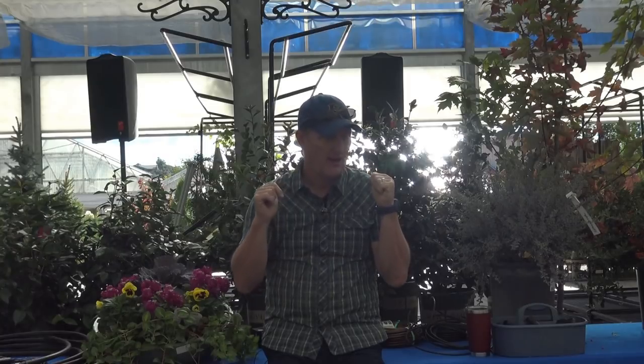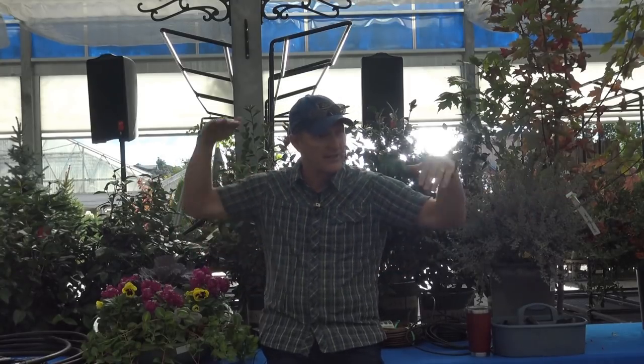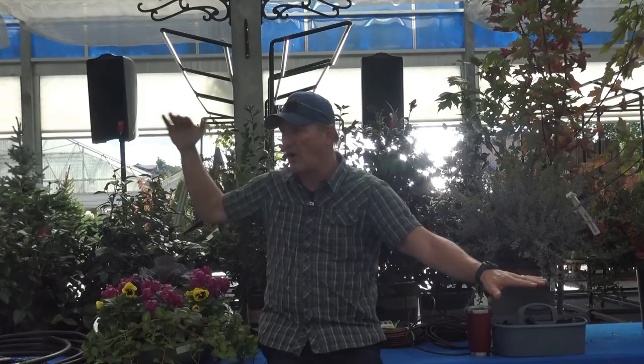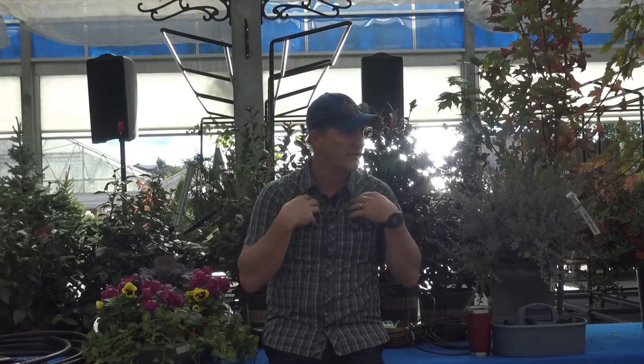In the backyard I've got exactly the same thing. I've got two flower valves — because it's a steep slope and the pressure drops maybe 20 to 30 feet going downhill — all the flowers down here on one valve, all the flowers in the raised beds up here on a separate valve. All the pots on one valve, and all the trees and shrubs on a separate valve. So I've got eight valves total in my yard.